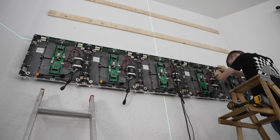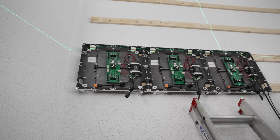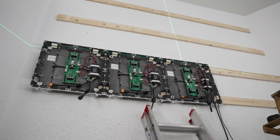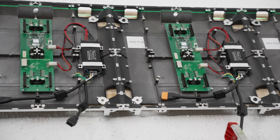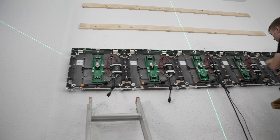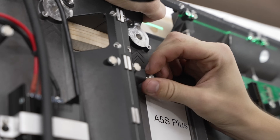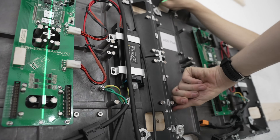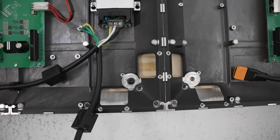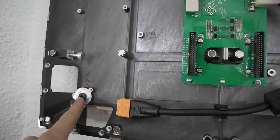We have our first row of cabinets almost mounted — Levi's finishing up the last one. We're starting at the bottom row, and this is where you want to be very precise about how perfectly aligned the edges of the panels are and that everything is perfectly level. You can see we've got our laser level going across the top — all nice and level, with our center point confirmed. If you get the foundation right and level, the rest of the panels on top are going to look great and will be easy to keep level.